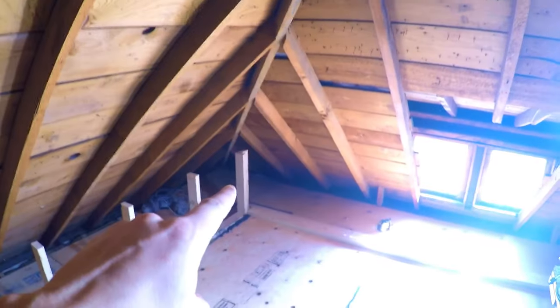Run my boards on top here, finish all the framing in that backside. And then hopefully today we'll get into the triangle cross pieces, the roof joist there, and going down from that wall to the other wall. That might be a little bit difficult. We're going to get into some fun angles, especially in the corner here, because we're going to have to kind of follow this up to the peak. Yeah, and try and make it as straight as possible, so that might be a little challenging.